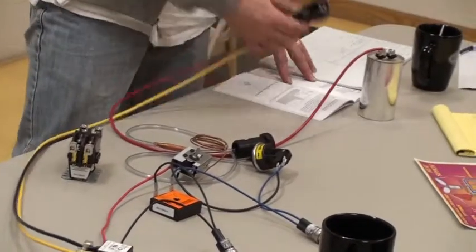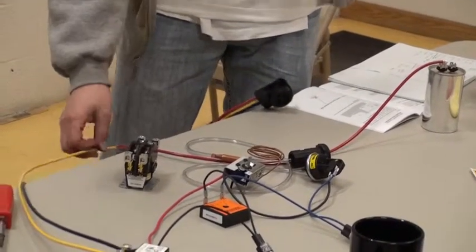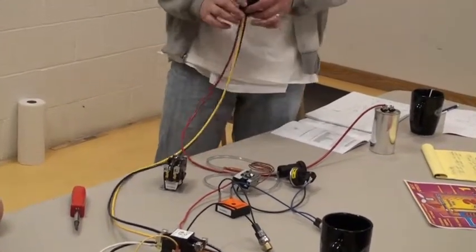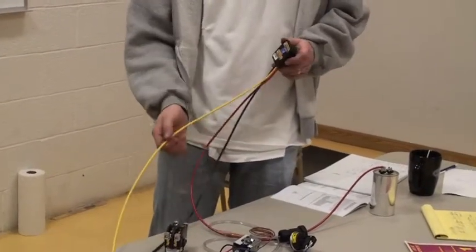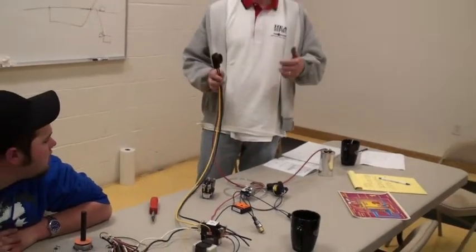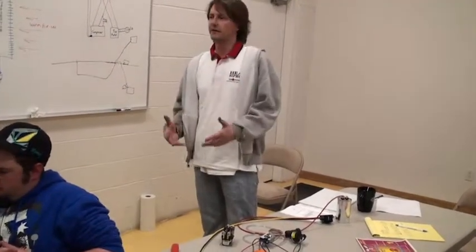And the only other place you can do it is go to the plug, pull the plug off the compressor, and see if it trips the breaker. How do I get to that? Well, on the new one you can reach over there. If you pull it and it's still tripping the breaker, the compressor might be fine — maybe the yellow wire was rubbing up against something and shorting. Something up inside the machine you can't see. You can replace that wire and keep going with your machine — another way to save the customer time and keep them happy.